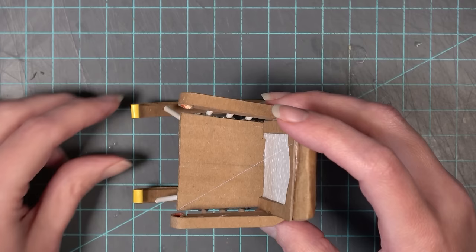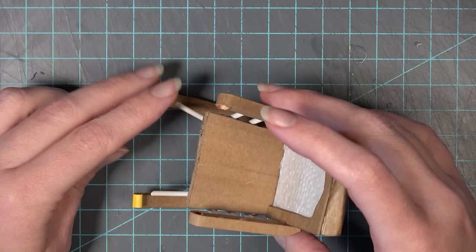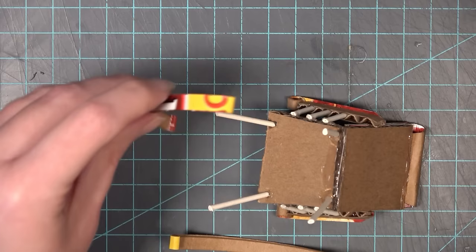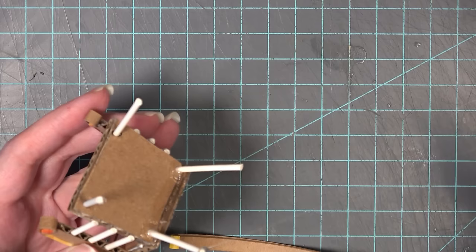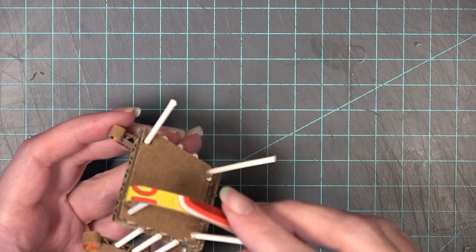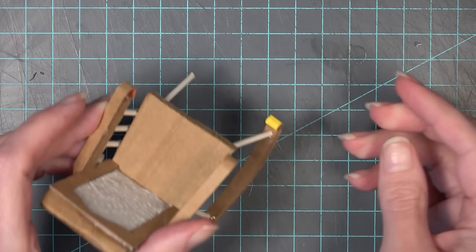Now that I have my legs on the chair, I'm checking them against the rocker positions and lightly marking with a pencil where I want the legs to meet up with the rocker so I can glue them while the rocker is face down on the tabletop. To attach the rockers, I add a small bead of glue and do one side at a time. I start with the right side of the chair, lining it up and gluing the legs onto the tops of the rockers, making sure they are in the correct spot and centered in the middle of the rocker.